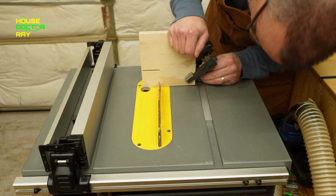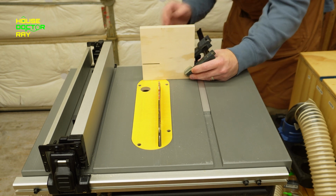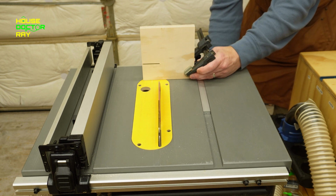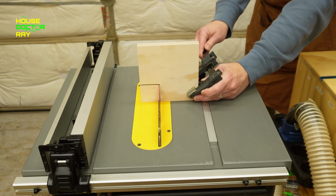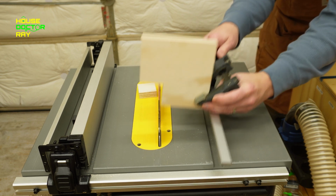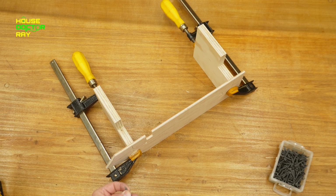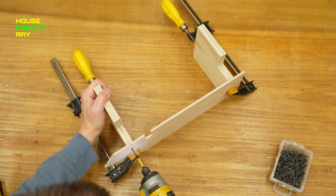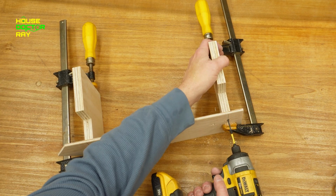And now I have to use this sketchy setup on my table saw with my miter gauge to cut a notch into these blocks of 6x6-inch plywood that I'm going to use for the brackets. Probably should have used a jigsaw or a handsaw. And I'm just temporarily screwing them to the adapter plate. For now, they're going to have to come back off.